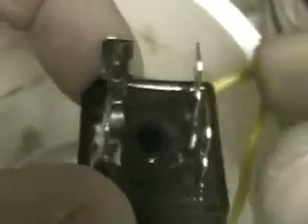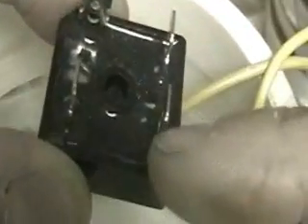Please note that it's DC, not AC. The reason it's DC is I'm using what's called a bridge. This is a bridge — we've got four sides. These two sides are AC in, and this is positive out and negative out. So you get DC out. It's a real easy way to change AC to DC.